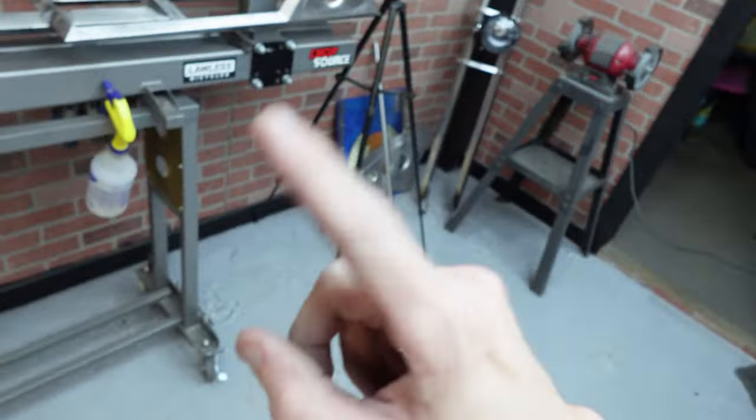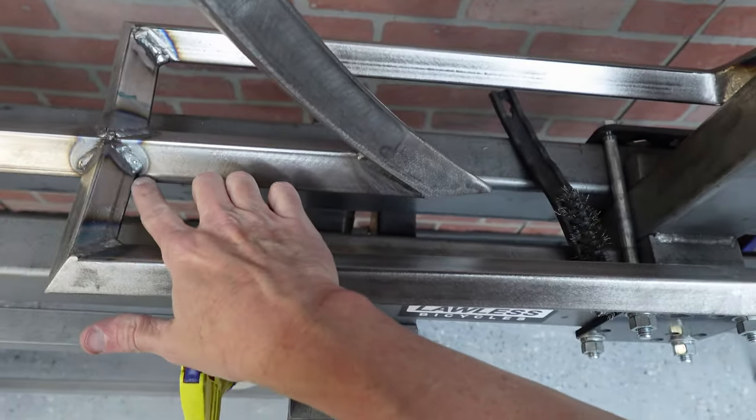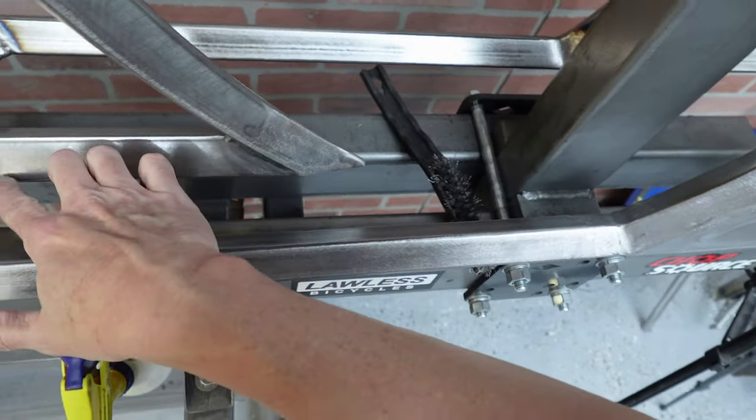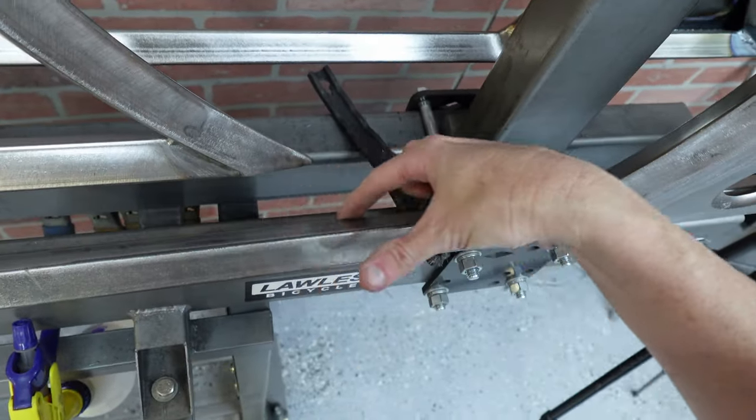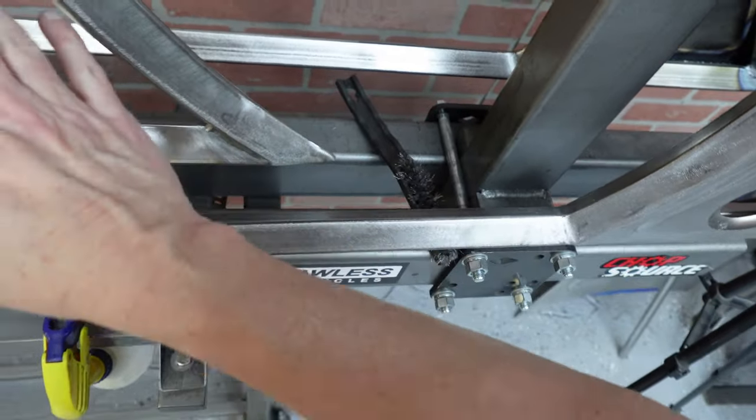Working on the tank. I am gonna go ahead and gusset here, and what I'm actually going to do is put the gusset on the inside of this lip here so that it goes out and comes in. And then I'll put some 1-inch dimple dies in there. We'll do that at a 16 gauge. That should make it plenty strong back there. Just to make sure. It makes me feel fuzzy. So anyway, I'm gonna call it a night, see you tomorrow.